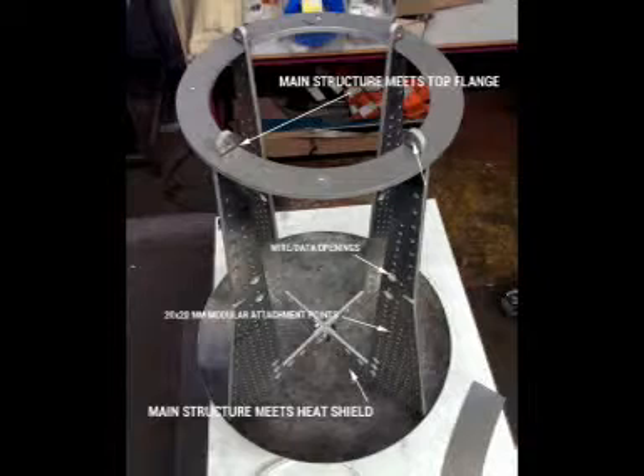For me, the next step is always going from sketch to SolidWorks, creating a fast but precise CAD model for subsystems spacing evaluation and for the next step, laser cutting in aluminum. The few parts that make up the capsule structure will be added a bottom heat shield dish, which was ordered from a company specializing in end cap parts.